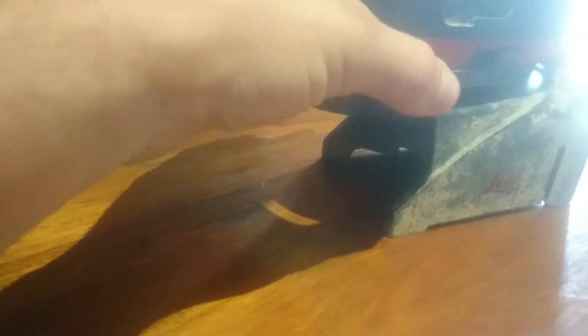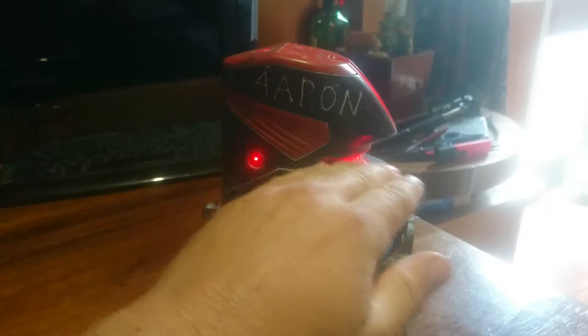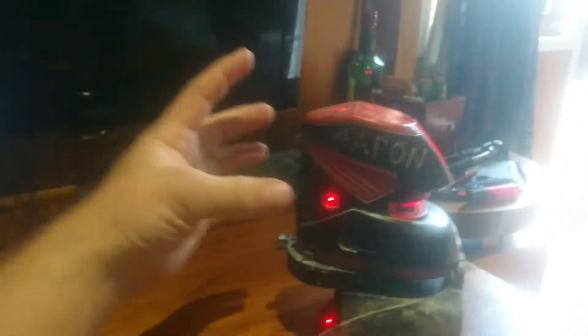The height the laser is away from the ground is very handy because when you're using the plumb dot, you want to be able to have space to get your pencil in there, or to easily see so you can line the laser up with a mark on the ground. For a construction laser level, you really want a level line, a plumb line, and the five points.